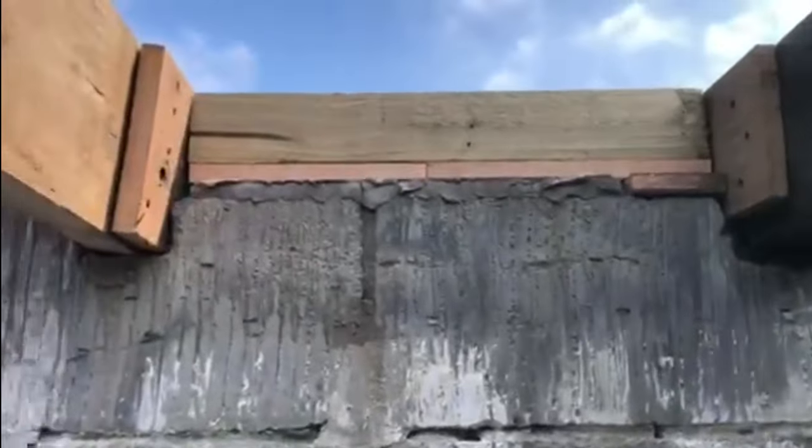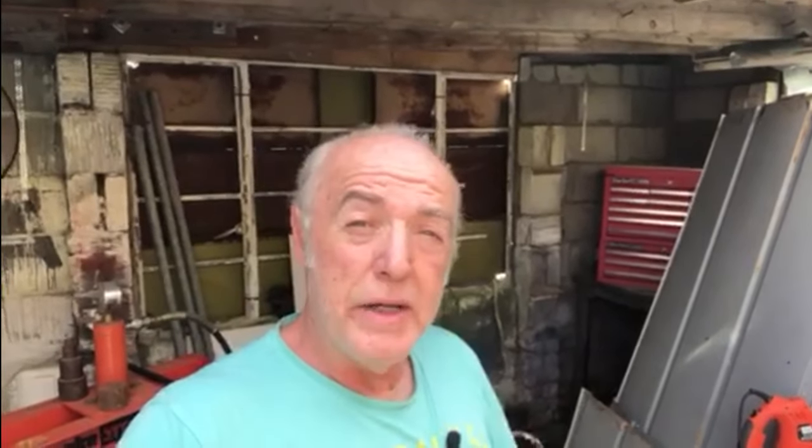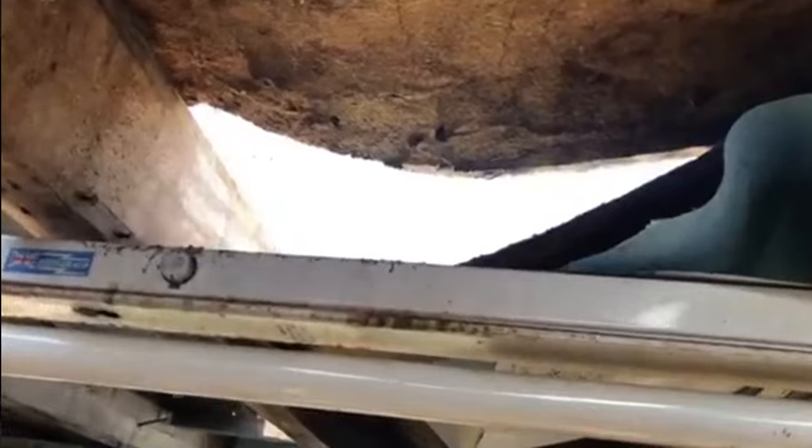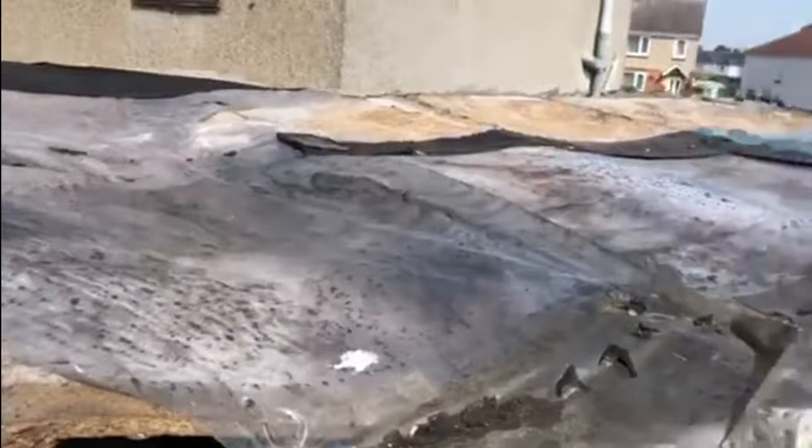Once I get this bit screwed together and screwed up in there - and that's that one in. Got that one in, got that one in. These little gaps of daylight you can see everywhere - don't worry about those, they'll be filled up once it gets completed and insulated. So we've got that one in, we've got that one in. Now I've just got the noggins done. In order to do that though I'm going to need a bigger pair of ladders. I need to take this down - what's left of the original roof.